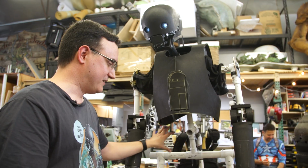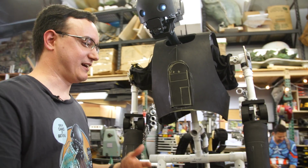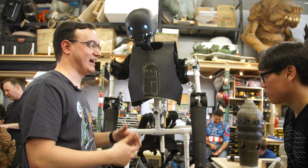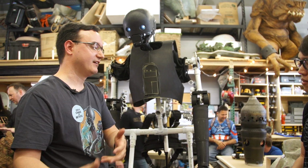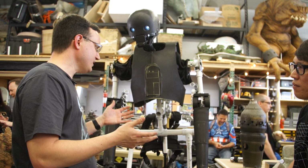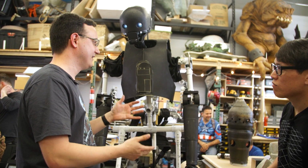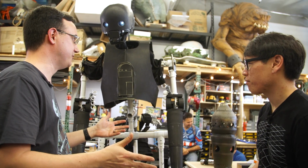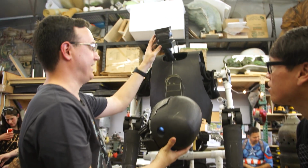I still need to flesh out the lower torso, but a lot of the time, like I said, was spent on the mechanics. How do you do the puppeting? How do you make him work? How do you balance weight versus materials? But EVA foam has worked great for him. You can form it into anything, put a bit of barge on it and it butts right up and instantly glues. But the head goes on this pan tilt head, and it's held in by rare earth magnets,